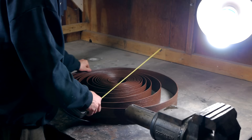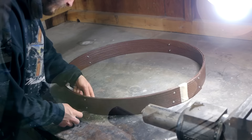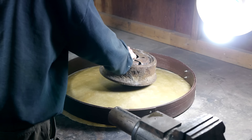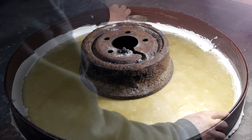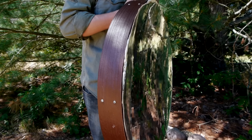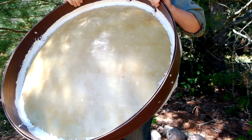I found this plastic landscaping trim that seemed like it would work well for this purpose. I quickly shaped it into a ring and held it together with nuts and bolts. The ring was then placed on top of my mirror, with a weight holding it firmly against my workbench. Some caulk secures the ring in place. And here is the final result — not too bad for being made from a $1 space blanket. I think an even smoother surface should be attainable if I inflated the mirror a little more before laying on fiberglass.